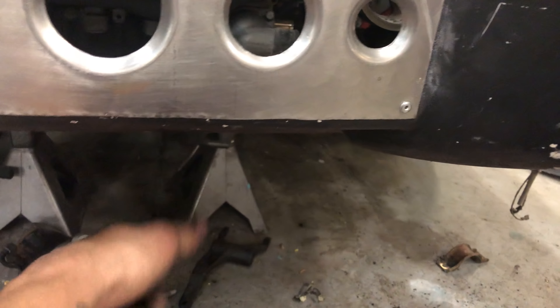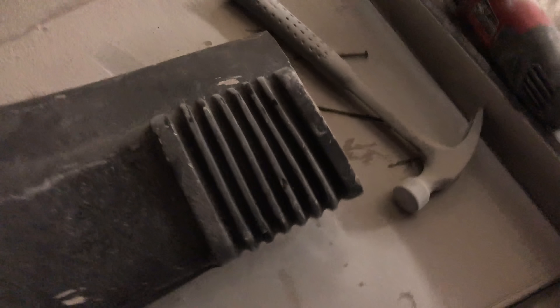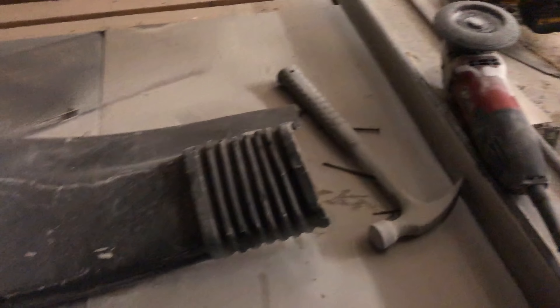I discovered that these bellows are not existent - I already did the other one and they're just literally piles of Bondo, which is stupid. I'm going to use the flap disc and get rid of them completely, and then I think I'm going to mold this piece to the rear bumper eventually just to make it look a lot cleaner. Make sure you wear a respirator if you're gonna do something like this otherwise you'll die. I'm in the wood room which is currently not lit, so I got lights right there and right there, I just need to hook them up.